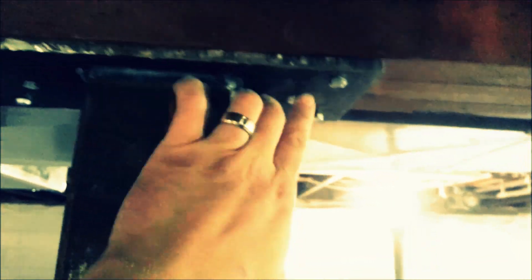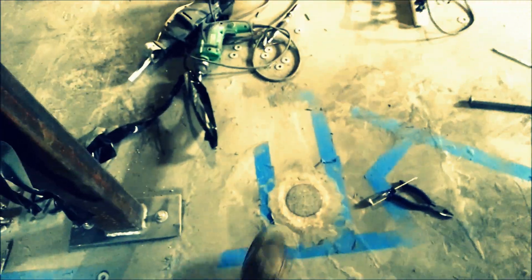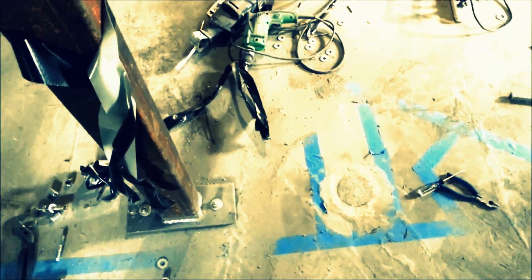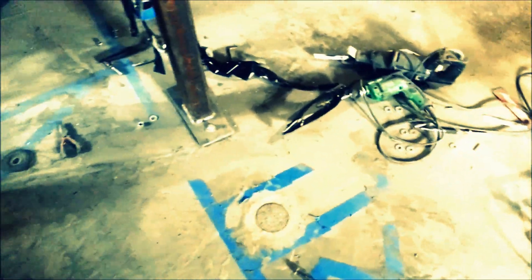As a quick bonus, this was the post that replaced the old one. This is a much thicker wall - quarter inch steel, and a 4x3 replacing the one next to it. It's got Hilti expansion bolts at the bottom, 3/8 inch thick by 12 inch long plates at top and bottom, and instead of two nails there are six 3/8 by 3 inch lag screws into each of the top header beams. It's a much stronger connection - I only moved it about 16 inches and it's well within the span. Make sure before you remove a post that you have an engineered design capable of supporting the loading above it, and never remove the old post before the new one is in place. Don't underestimate the loading above you and don't move a post without putting the right one in the right place, properly connected.